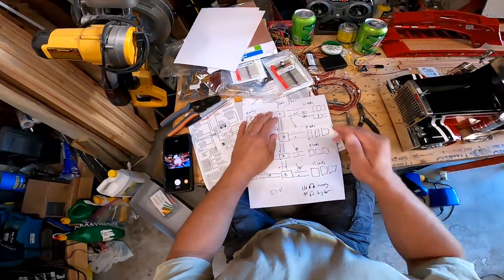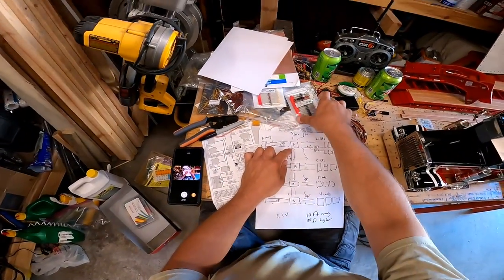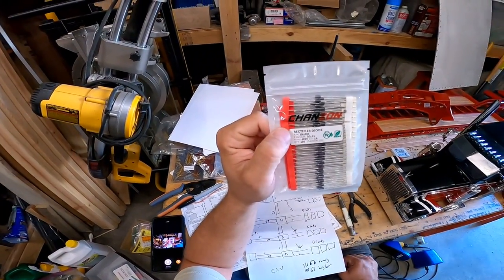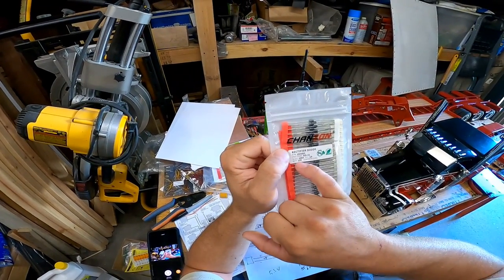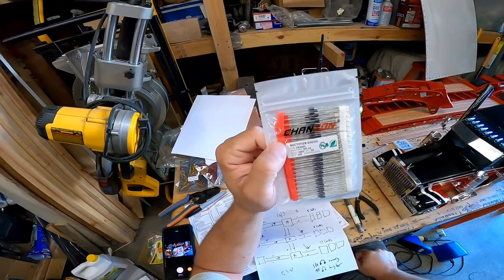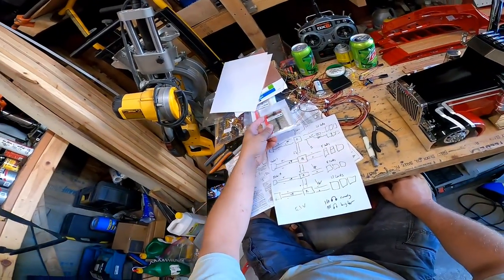All right. Now, from all my other diodes, which you'll see, I'm going to have one feeding from this to each one of those other circuits. And those are right here, rectifier diodes. So part number 1N4004. These can handle up to 400 volts, and one amp can pass through them safely. They're a couple dollars, whatever. So that's what I'm going to use.